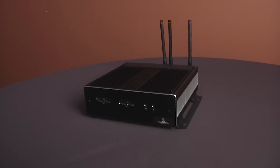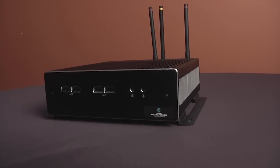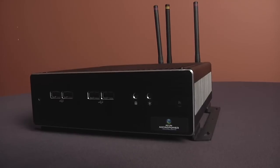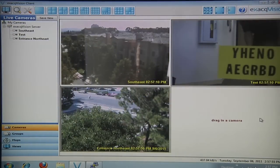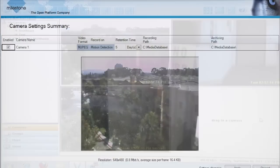The hub is the component that talks to the camera, and the camera talks to the hub. To ensure a clear Wi-Fi signal, the hub actually sniffs the air to see if there's a Wi-Fi transmission in process. If there is, it waits; if not, it immediately asks the camera to send the frame. This is what allows us to function in a friendly manner in a crowded environment. In turn, the hub hands off the data into a traditional network, allowing us to support existing commercial VMS devices.